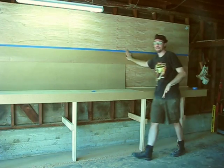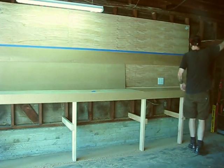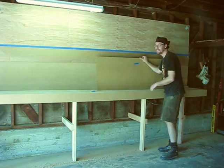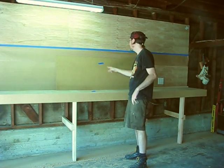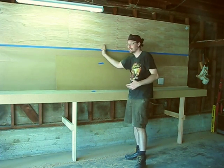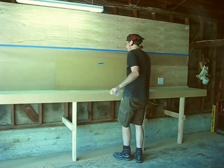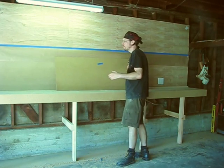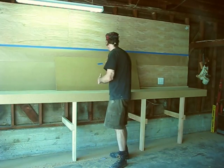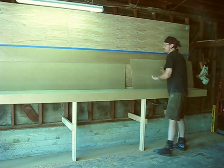This is kind of old tape so it's not as sticky as you might wish. Now, I've dry-fit these as a reality check. I've found the edge that fits best against the backsplash. I've marked them right and left, this edge towards the end. So there shouldn't be any chance to flip it around and cause problems. From here on out, same thing: you want to glue the table, and you want to glue the backs of the countertop pieces.